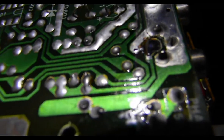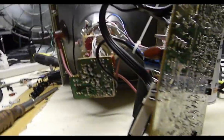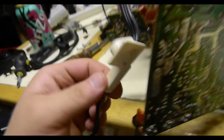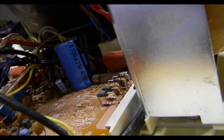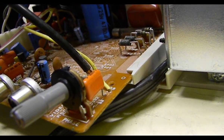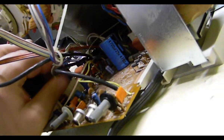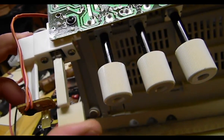You see some failing solder joints on the video port there — that's what failed in both of them in the last monitor I had, and on some of the controls as well. On the off chance somebody's watching this video because they're having issues too: to remove the chassis, all you gotta do is take out two screws, one here and one here, and the transformer slides out. You can unplug that and the whole chassis will come out, because the thing that holds in the transformer also holds in this plastic piece for the power cord.